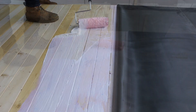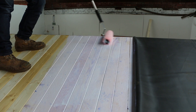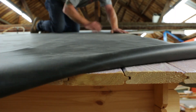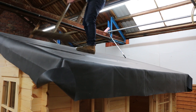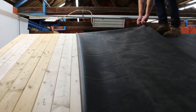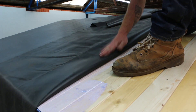With an apex roof, it's easiest to pull the glue up the roof with the roller to prevent it being pushed towards the edge. Make sure to roll over the top edge of the apex just in case there is a gap between the panels, to ensure that the roofing is well sealed. Once you have spread the glue, pull the rubber over evenly to cover the area and repeat until you have reached the end of the roof. With one half finished, use a brush or broom to sweep the rubber down towards the edges, removing bubbles and wrinkles. You can then pull the rubber back to expose the other half of the roof and repeat the process. The glue dries tacky and stays pliable; as it dries into the wood, the rubber will be drawn down forming a seal.